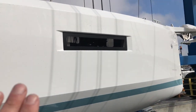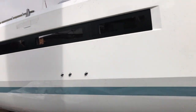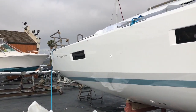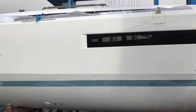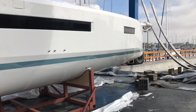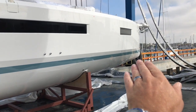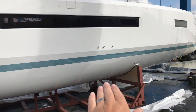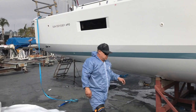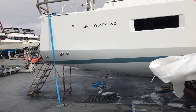One thing I want to point out is the nice large windows. You can see just how they brought the volume so far forward, and you're going to see that down below, because this 49-foot vessel feels like you're in something much larger — at least in the mid-50s. The whole design is really innovative. Full hard chine from bow to stern, with a nice reflex from the bow cambering down to where the keel sump is and then back up. This is not a flat-bottom bow — really nice control and stability.